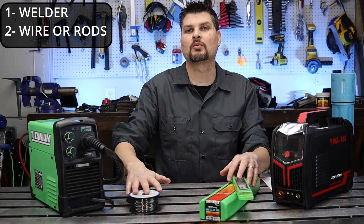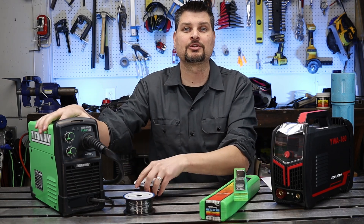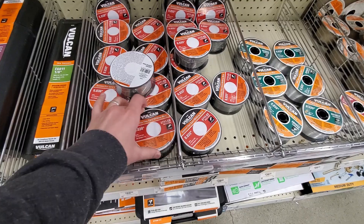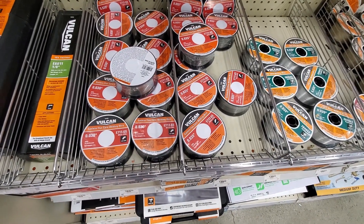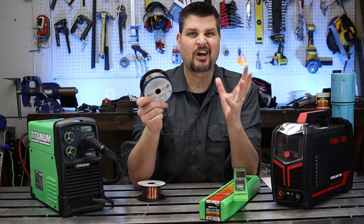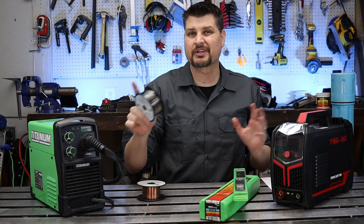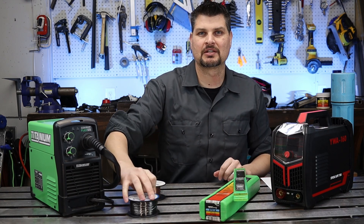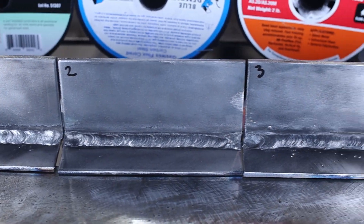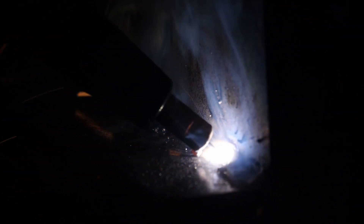Not very many welders come with rods or wire, so second on the list is just that. If you ended up going with a flux core welder, do not buy the shiny copper looking stuff — this is solid core wire for MIG welding. Make sure it is a gasless flux core or inner shield wire. It is more expensive, and as far as the size, I would say go with a .030 or 30 thousandths of an inch — it will get you through a majority of your projects. If your welds aren't turning out great, lots of people like to blame the wire, but the main cause is actually mostly your speed, stick out, or technique.